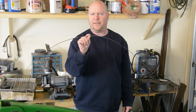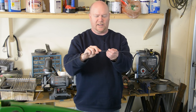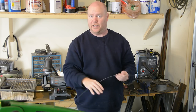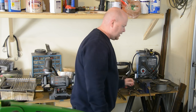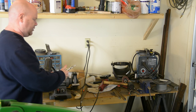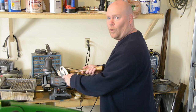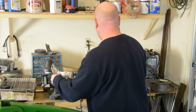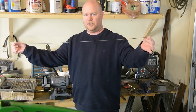One complication is that these elements do need to be straight — this is not going to work. Sitting here bending this copper out takes forever and it doesn't actually end up straight. There's a trick you can use: snug one end of the wire nice and tight in your vise, and on the other end get a pair of channel locks or vise grips. Make sure you've got a really good grip, then give the vise grips a whack with a hammer. You're stretching the copper, so don't overdo it because you'll make it brittle — but it comes out perfectly straight.